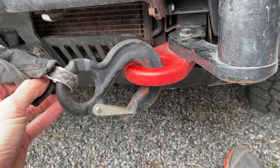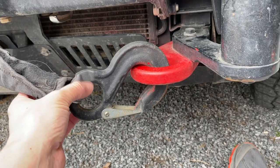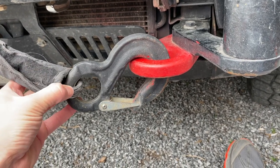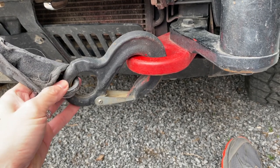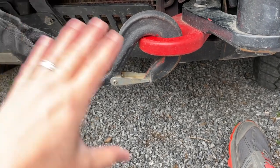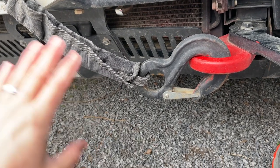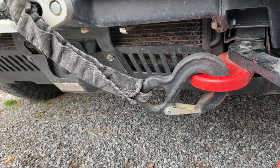It's kind of cast on, so the only way to get this off would be to saw it off — maybe with a grinder or a saw tool. If you do it that way, the eyelet would be intact and you could just attach a new point. What I'm going to be doing is actually cutting the winch line and removing this whole thing, and then we're going to be splicing the whole line back together. Hopefully that all goes well and we'll show you what it looks like.